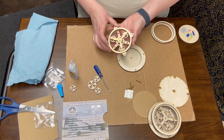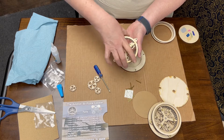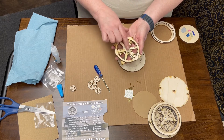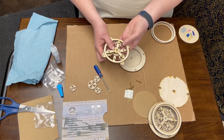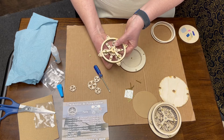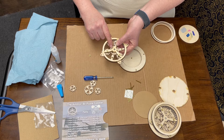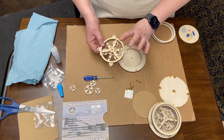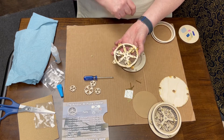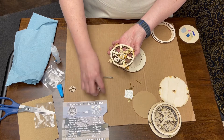Now if you come back to your puck - this is the top layer of gears - we're now ready to put the bottom layer of gears in, so we're going to flip it over carefully. We have to do something with this center screw because I can't put a big gear on that center screw. Instead I'm going to put my finger here to hold that screw in so it doesn't fall out, then ever so carefully pull that screw straight down, flip it over, and put it straight back in. Now before I assemble it I'm going to put a finger on that middle screw, flip this back over, and now you'll notice that I have four screw heads showing - so these are upside down. I'm going to put my new four gears on the bottom.